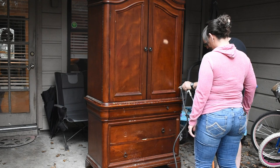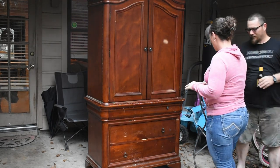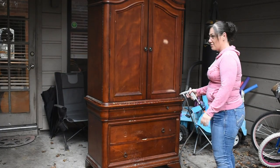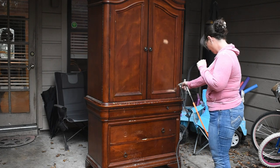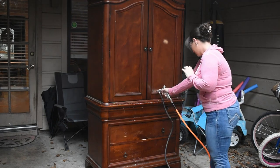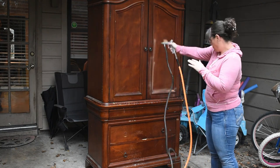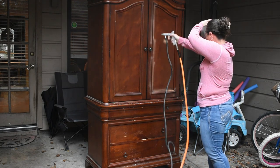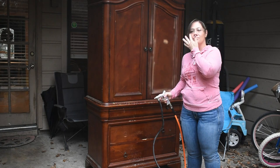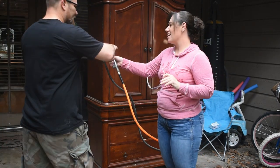My husband thought it might be a good idea to try sandblasting — and as you can see, it got me right in my face. For those not familiar, sandblasting basically tries to get the finish off a piece of furniture. That black hose is connected to a bucket of sand — which I think is actually made of coal — and the other hose is hooked up to an air compressor. You squeeze a little trigger and the sand blasts out. It does work, but the problem is it was blasting back in my face. I am not having a good time, so I hand this off to my husband.